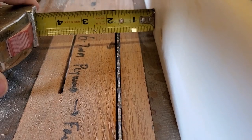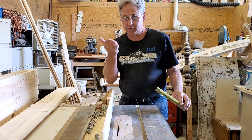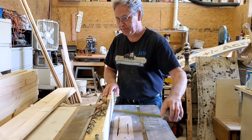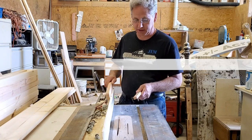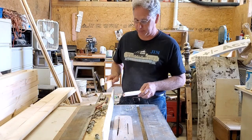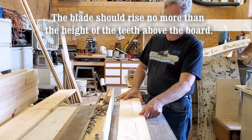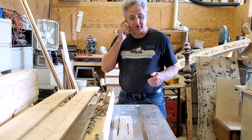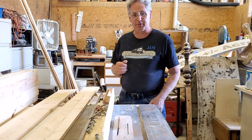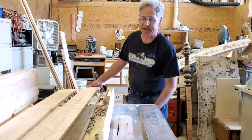I'm going to move the fence just a little bit. You measure from the front and back side of the blade from the kerf tooth that's pointing towards the rip fence, and we're going to be right there. I'm also going to use a push stick because this is a very dangerous operation — I keep push sticks within arm's reach. Make sure your blade height is set about right, and we're ready to cut those boards. Always use your safety glasses and keep safety in mind at all times.